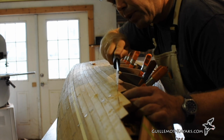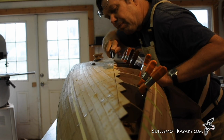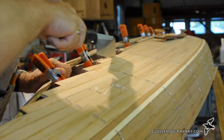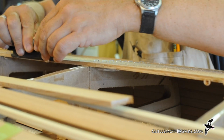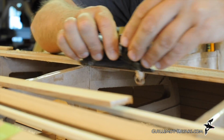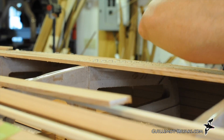I'm cutting as close to the line as I can without touching it. A side rabbet plane works well to true up the center line. I'm using the Stanley 79. I keep checking the edge, first to make it straight, then I concentrate on getting it on center.